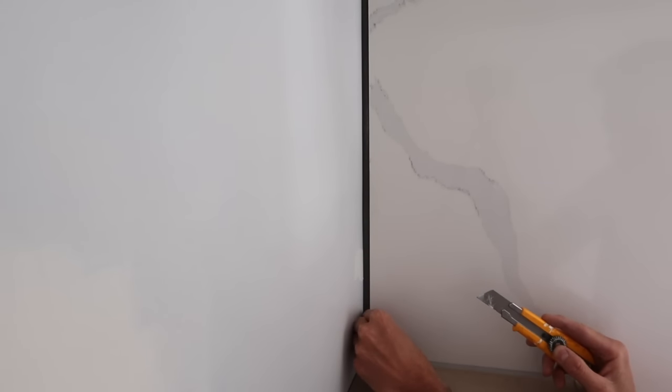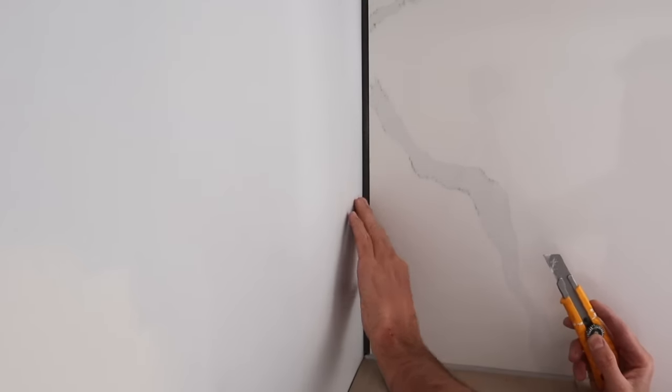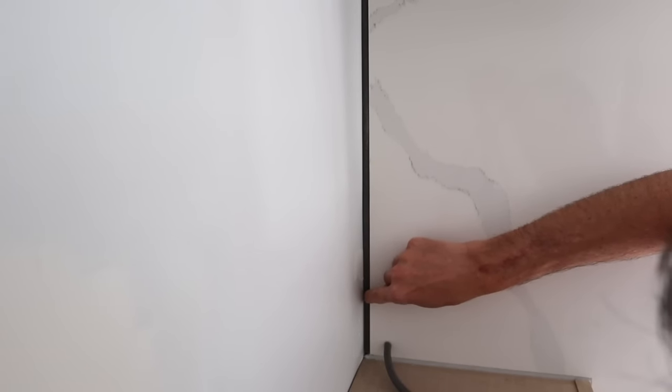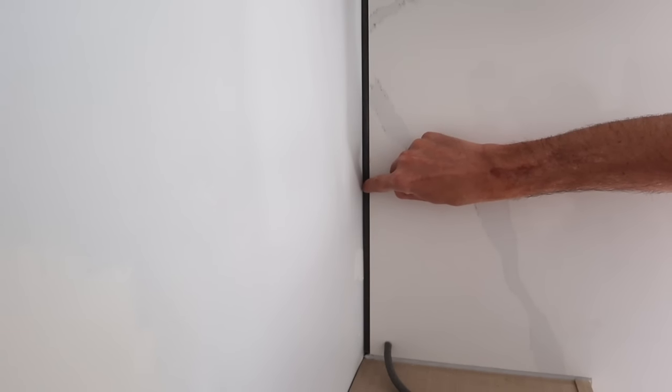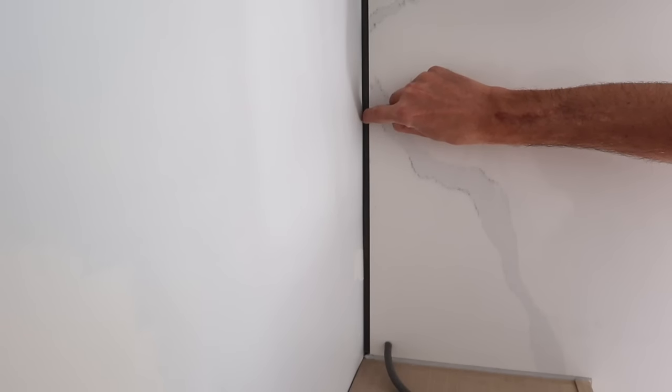So we are not gonna be using silicone caulking today. We are gonna be using latex caulking because it's going up against a wall and it needs to remain paintable. So right now, I'm working on getting it to about an eighth under. And it needs to be pretty uniform, otherwise it'll shrink at different rates and it won't be flat.